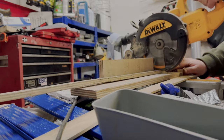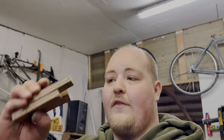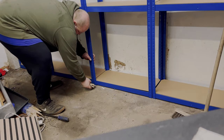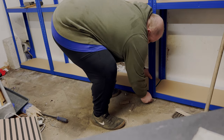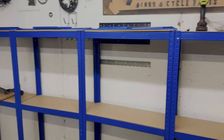Job's a good'un. There's one good thing about doing a van build — we've got to shim the shelves. You end up with a load of random offcuts like this 12mm ply. Let's cut it into chunks and stack it under each foot to bring the shelves back up to straight, because that way nothing ends up falling over. Now that they're all bolted together, they're a lot more sturdy than when they are individually. And there we have five little shims to go under each one of these legs. Let's get them in. And there we go — shimmed all the way along, which makes the racking stand up straight against the wall.